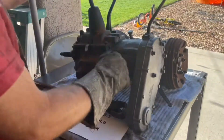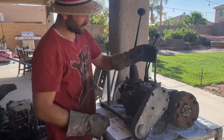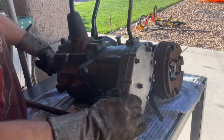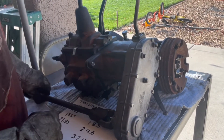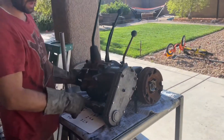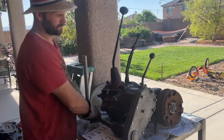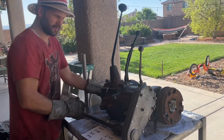With the power takeoff here, I'm going to put it in first gear. Now I disengage this so the axles don't move. Right now we've shut off all power from the engine to the axles with this. Now we're going to run some power to the power takeoff. I keep it in first gear and then I engage it with this lever — pull it back — and now this thing moves. This will run this shaft up to a winch in the front. Take it off and there's no power from the engine; turn it on and power turns on.